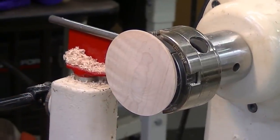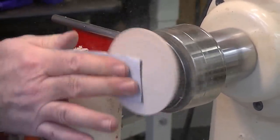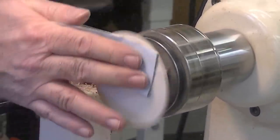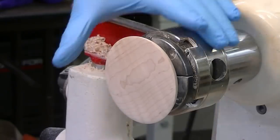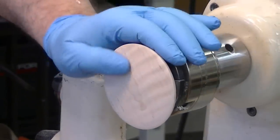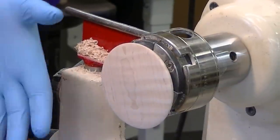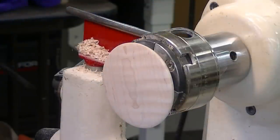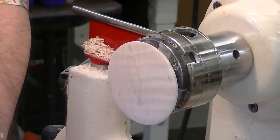It's a matter of sanding it now. The curly maple — I like to do a double dye process to make that curl just jump out even more. And so to do that I picked two colors — this time I picked a green and a yellow. Use the dark color first, because if you use the light color first the dark color is just going to include it. So using the dark color first.